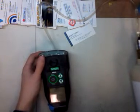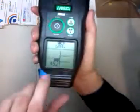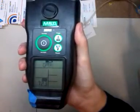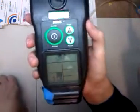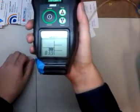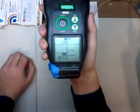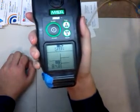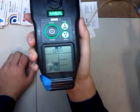Connect the hose right into the top inlet port. If using a demand flow, gas will automatically begin flowing from the regulator. You'll notice the reading goes up relatively quickly — VOC meters and PID detectors in general respond much, much faster than electrochemical sensors, so you'll see that value jump much quicker. That's a good thing. Now just wait for the calibration to complete.